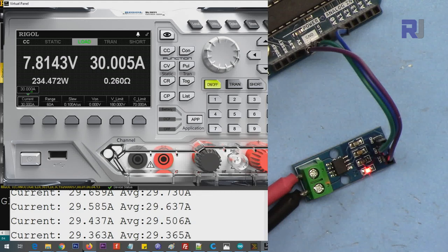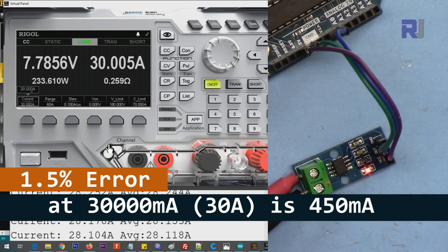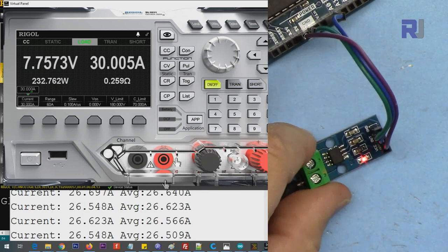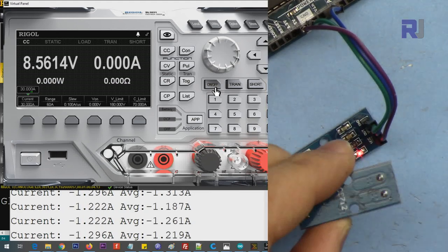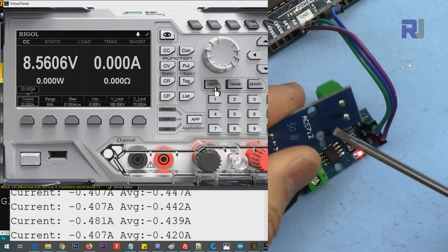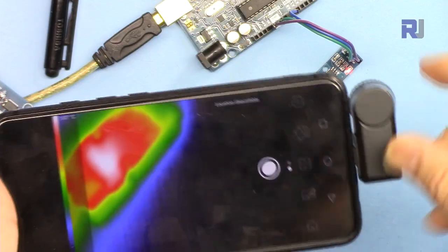At 30 ampere, this is the Arduino serial monitor producing the result. There is almost a 2 ampere difference - that's a huge difference. The module is also heating up for 30 ampere. This is a very bad design to put that much current through these tiny terminals. The PCB trace is too thin - even with double copper, the PCB should be much thicker to safely carry 30 ampere.